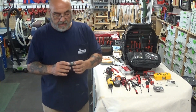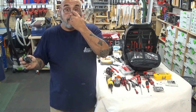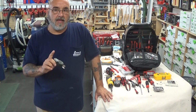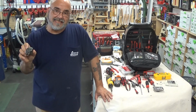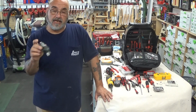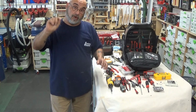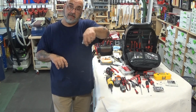Oh, also one other thing is one of these outlet testers. The one that tells you if there's an open ground, an open neutral, no ground, or if it's correct. In the first video, I stressed that it is very important for a Rinnai to have a ground. If you have an interior Rinnai, or even an exterior Rinnai that has a pigtail on it, one of your diagnostic checks is whether it's got a grounded plug. By pushing this in, it will tell you if the two lights on the side are lit, it says correct. Then you can check inside, make sure it's grounded, and that's why I carry stake-ons to re-splice and make the connection.